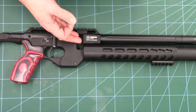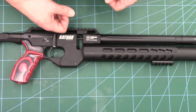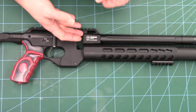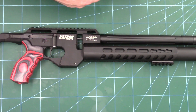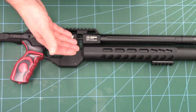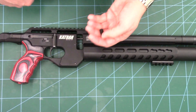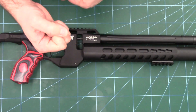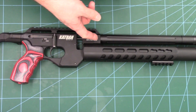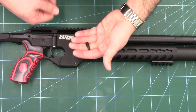For sub-12 rifles, the air is able to expand before it gets to the back of the pellet, losing a small amount of energy and slowing the potential velocity of the pellet down. To overcome this, you have to hit the valve harder and release more air so it's not able to expand as quickly as it travels through the block. That's where this little plug comes in — it stops the air from expanding so quickly, so more energy is available to the back of the pellet.